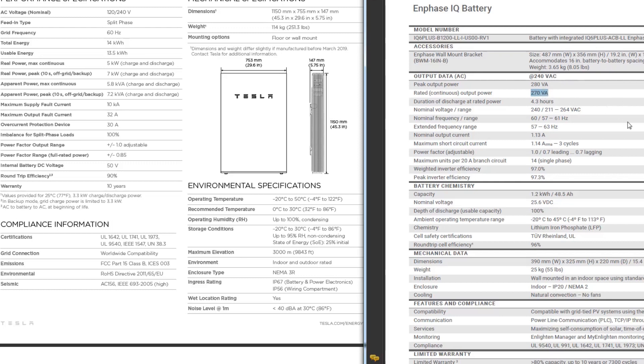What I am seeing with two batteries installed is it's putting out about 520 watts with both of them running at full. So when the solar goes down with just the normal load on the house without the air conditioner kicking in, it accounts for about half of our usage in the evening with just two batteries. So it's not really covering everything, it's just covering some of it.